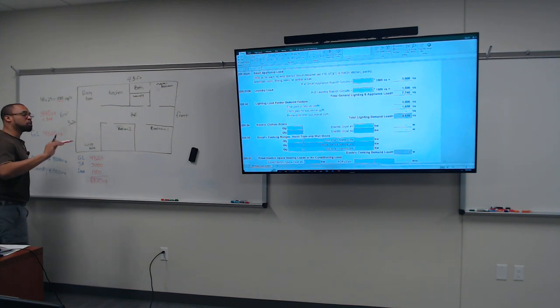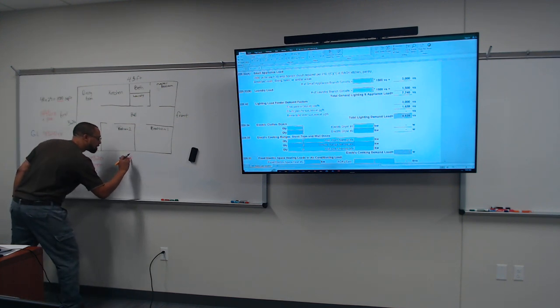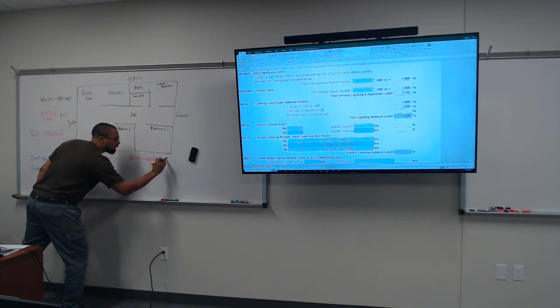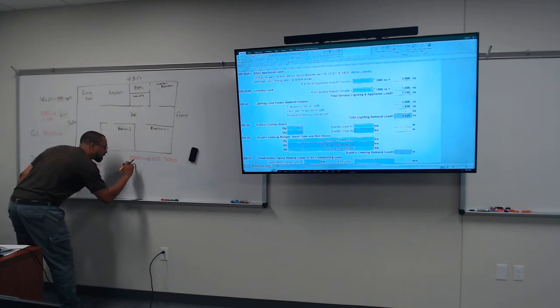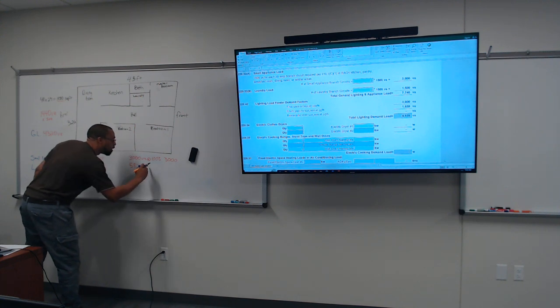All right, so what we're gonna do is take the first 3,000 of 8,820, right? So we're gonna take 3,000 VA at 100%, which is 3,000, okay? And then what we're gonna do is subtract 3,000 from 8,820, which you say is what? 5,820. Yes, 5,820, now we multiply that by what, Mr. Lopez? 35%. Yes, 35%, okay? All right, and.